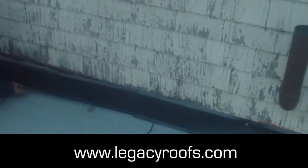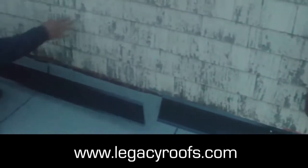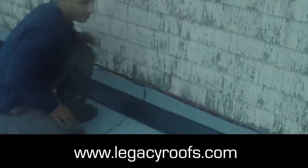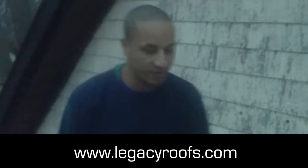The client's going to be extremely happy that we stopped these leaks. We have some flashing — I just might as well show you now that it's on. We want to make sure the water sheds off the face of the facade and onto the roof, so we protect the edges of the felts and membranes itself.